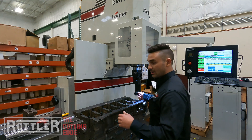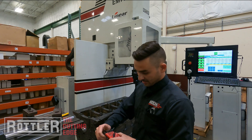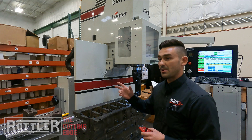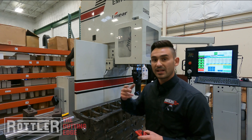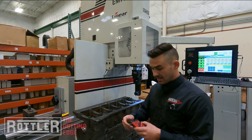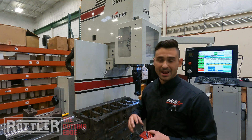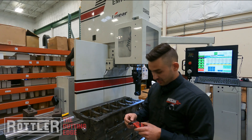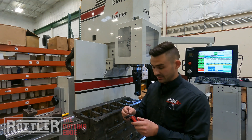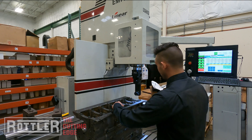Our final step here — the fun part — is to go ahead and cut these bores. What I like to do is set my cutter up so it's just under, maybe five or six thou undersized minimum of what I would be cutting to, and I want to just take a witness pass, a little skim pass, and make sure that the program looks right. Then I can measure that and adjust on my boring micrometer if I need to.